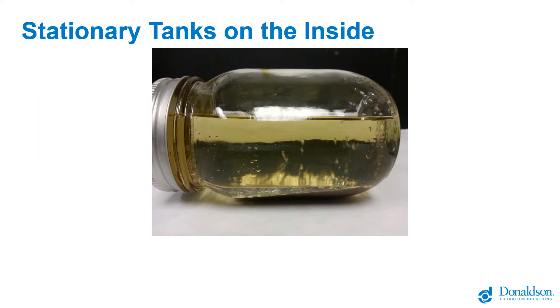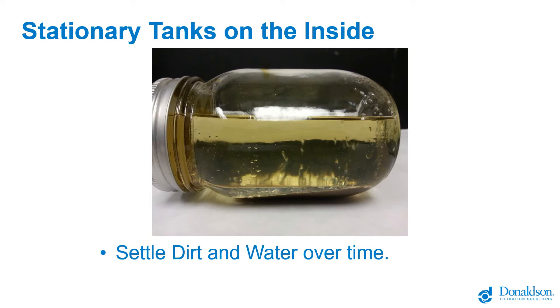To give you an idea of what's inside a tank like those stationary tanks — the tank is designed to use gravity as part of the filtration system. You can see this is diesel fuel sitting over the top of a little bit of dirt and a little bit of water in the bottom of this simulated tank. It's just a glass jar, but it gives you the idea that water and dirt settle to the bottom, and fuel is typically drawn from a few inches up off the bottom to avoid the settled material. That's the way tanks have been designed for the last hundred years — the dirt and water settle and the fuel gets decanted off the top.